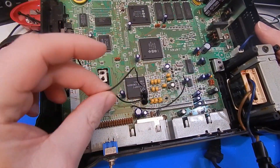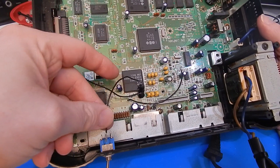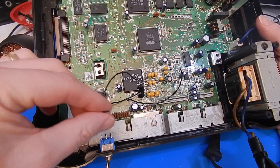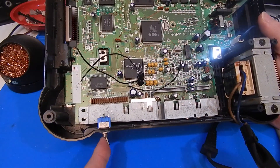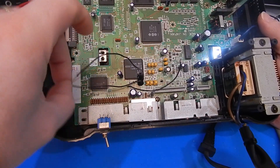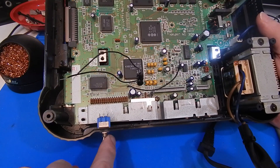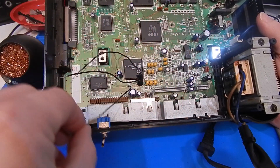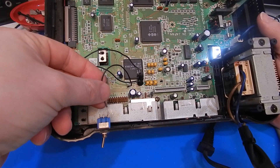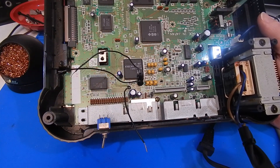So this is the wire going to the chip — we need to run this to the centre leg on our switch. This is our 5 volt; I want the switch 5 volt pointing towards the power supply, so we need to run that to this side of the switch. And then pointing away from the power supply, that will be ground, and this one needs to run to that side of the switch. Very simple — I will get this wired up now, then we will be back to test it.